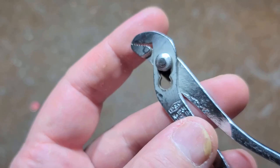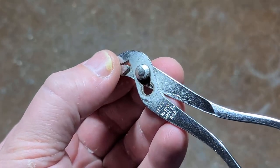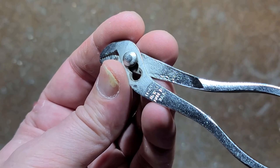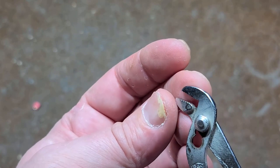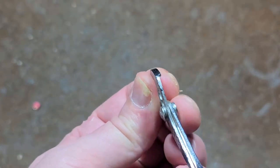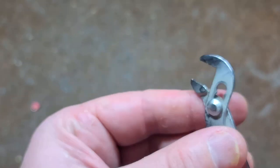These would also be handy for small components in electronics. There are often little screws with nuts on the backside that are hard to access with tiny sockets, even quarter inch. A lot of people may not have a set of ignition box wrenches, and even with box wrenches the nut can fall off into nowhere. A little set of pliers like these lets you grab the small nut and hold it while you unscrew the fastener.